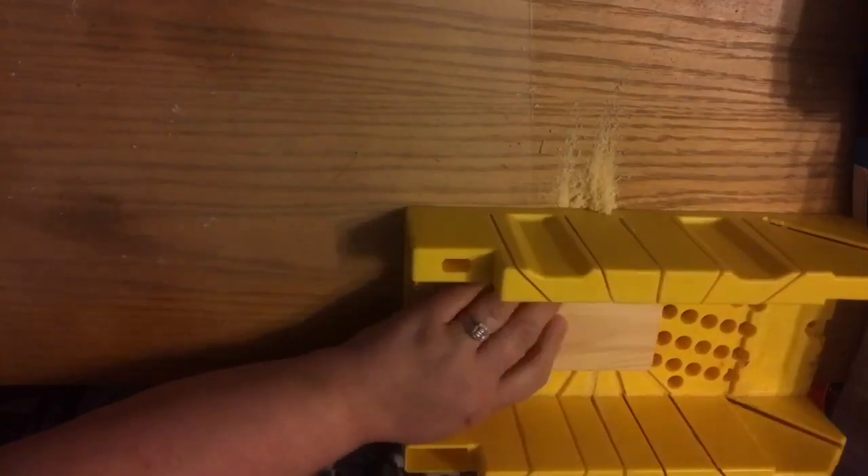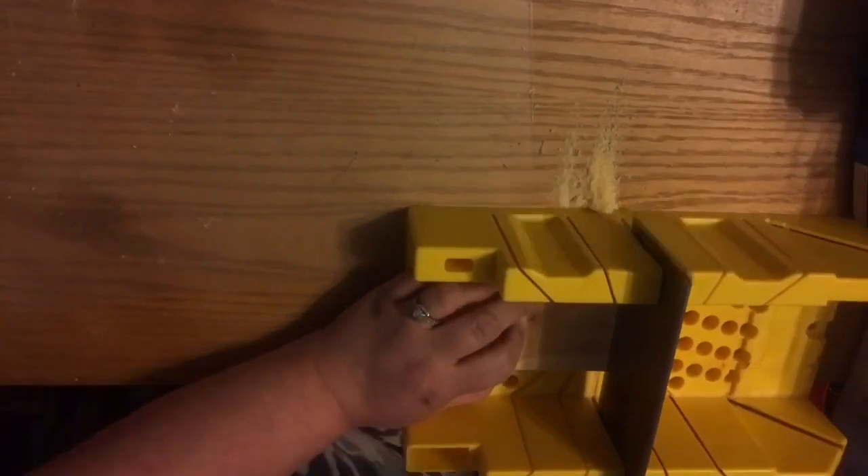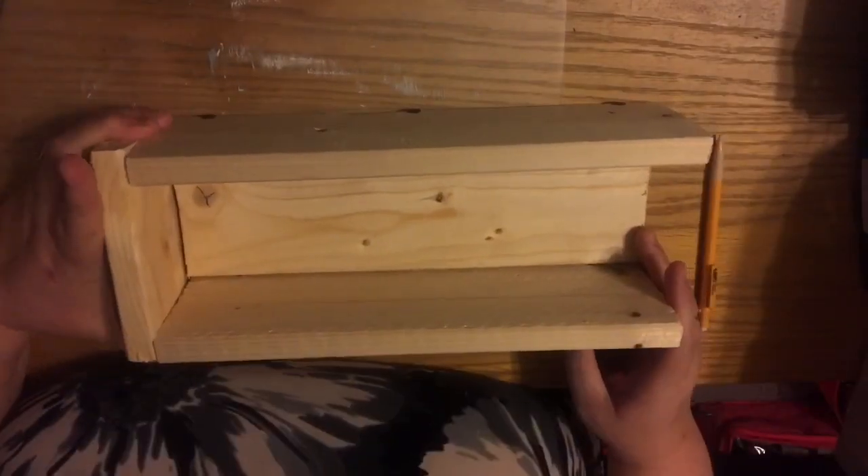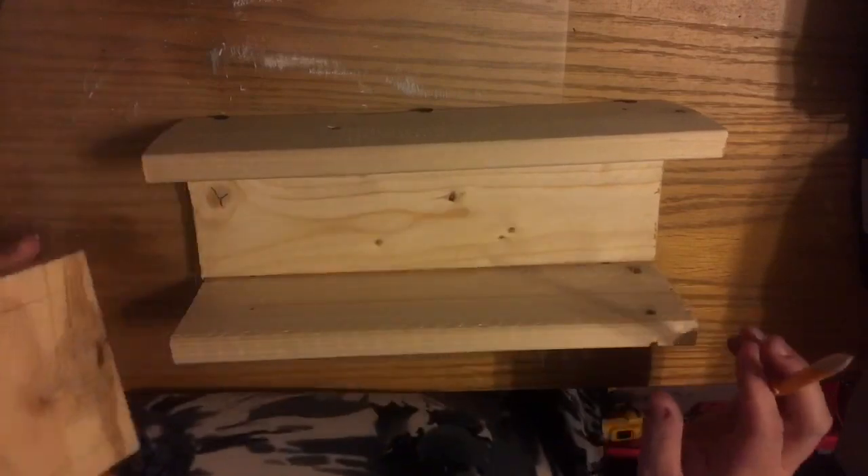That's sawdust on the table — I'm not cutting my table. This particular miter box has a guide on the top that won't let you cut all the way to the bottom. I always put it away when I'm done to protect me, my surfaces, and the blade. So I'll just do a little bit of cleanup and get to screwing. We're going to do the same thing we did before — we're going to pre-drill our sides so as not to split the wood, and I'm marking.